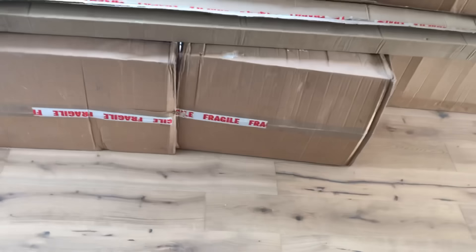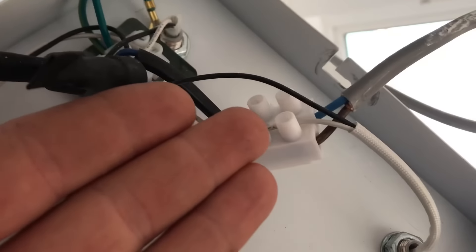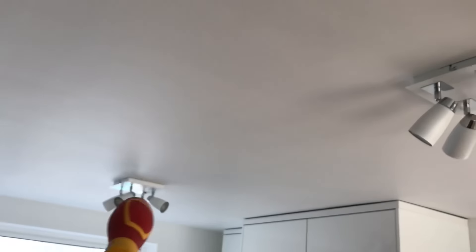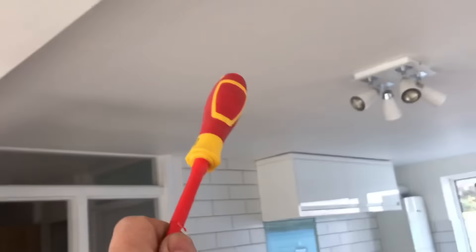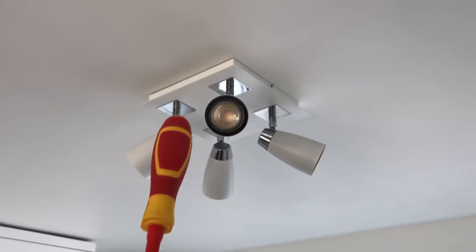I've started visual checks on the lighting. They've had brand new, quite expensive, good-quality metal light fittings. No earth connected — he thought he wouldn't use that, put connectors on it and chopped the earth out. So potentially if this becomes live you'll get an electric shock. I refixed the light. There are more of the same — inaccessible joint boxes with no earth above an overboarded ceiling. And surely there should be some sort of isolation in here for these tails.